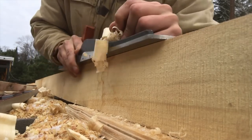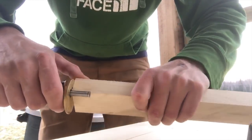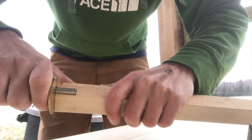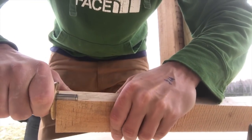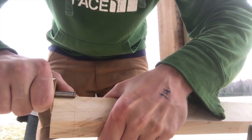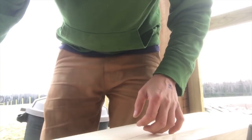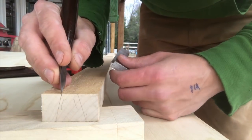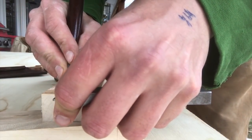So I'm just flattening the top, and then pretty much the same thing here for finish wise, but I wanted to embellish it a little bit and include a dovetail where the two sides of the apron would meet. I thought that would look better than just a miter. So just cutting a dovetail here, and then to attach the apron to the countertop, I drilled some pilot holes, and I actually screwed it to the countertop.